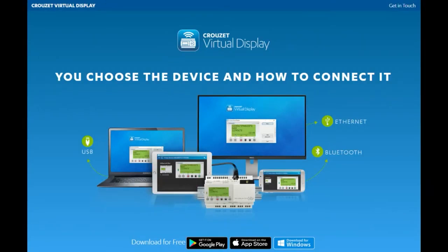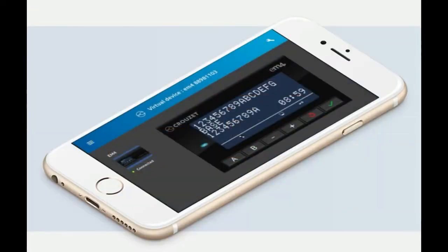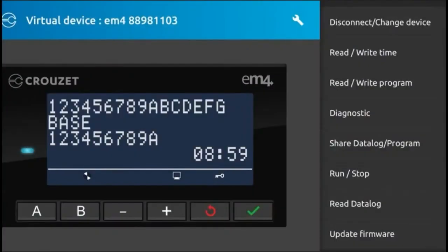Another interesting thing: because this PLC does not have an LCD or TFT display, you might wonder how to get debug output or see a count or do analysis. Well, over Bluetooth you can use an app for the debug and user interface when needed. A lot of PLCs — you're not constantly pressing buttons and reading output; it's only for analysis and debugging. You can download the app for iOS or Android, install it, and see a simulated LCD output with button inputs, do diagnostic checking, and download data logs.